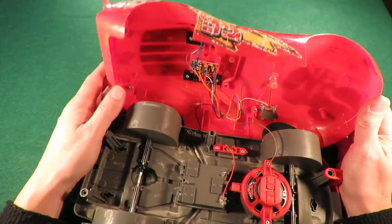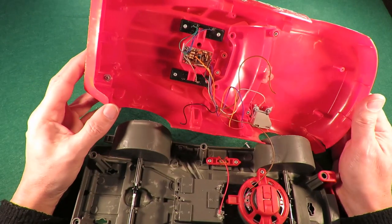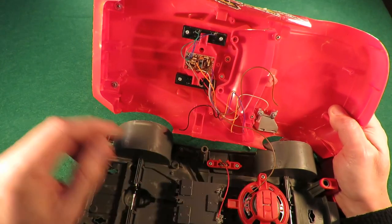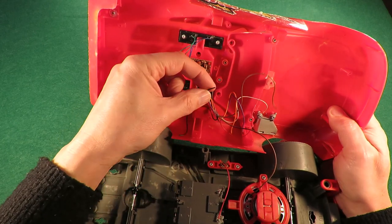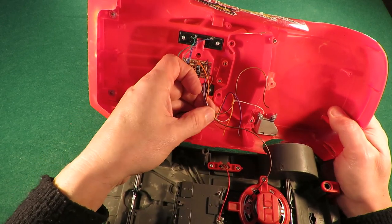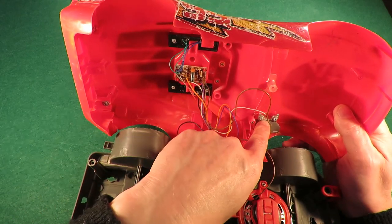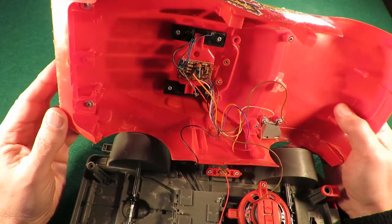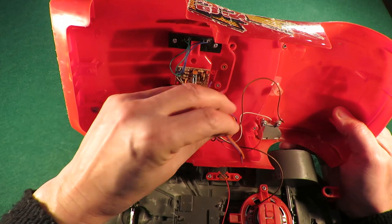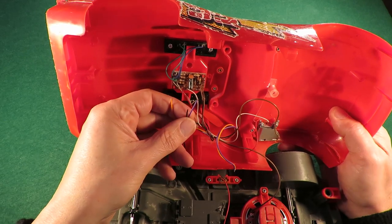So what I'm going to do today is see if there's any way of actually guessing which wire is which and soldering them together. I think we're pretty safe guessing that those brown wires are for the speaker. Then that black wire which is disconnected at both ends would be the negative from the battery. There's a red wire I spotted — it goes up there. There's an LED there. So one of those other ones is probably the power; it could be the orange or the blue, or purple. We've got three disconnected there.